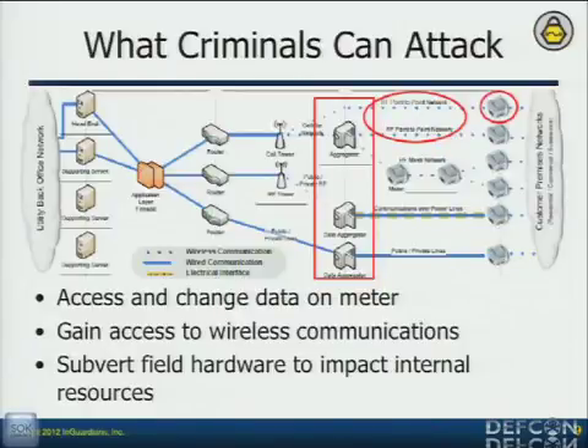The stuff outlined in red — those are the publicly-facing devices. The one on the far right is the smart meter. Smart meters can be meshed together, communicating over 900 MHz with other meters and with pole-top aggregators. Or they have network interface cards with two cellular modems — 2.4 GHz — and those talk directly back to the cell tower. We're concerned with all those red devices. The rest — the cellular network, edge resources like routers and firewalls, the internal network — that's just like a business network.